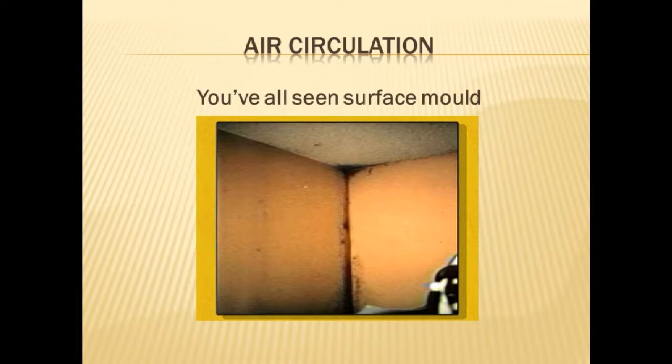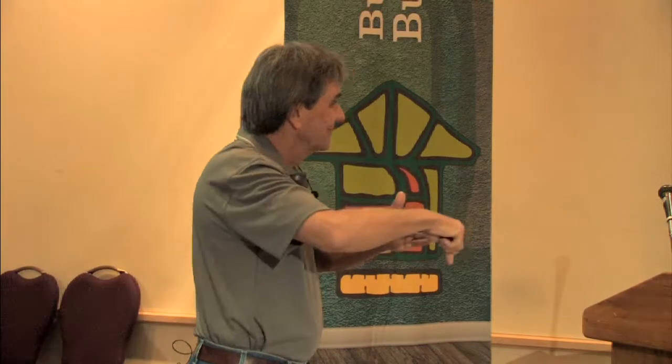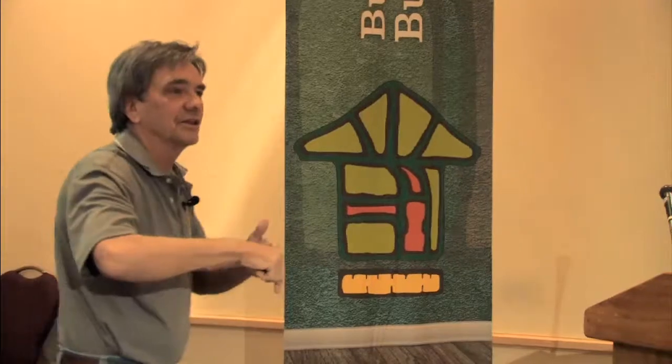And there's actually air coming between the double header, coming into the drywall. And that's why the northeast and northwest corners of the house are the first places to get the mold. Coming down this wall would mean that they built that poorly, and that when they put the stud walls up, somebody forgot to put insulation in the corner. And so that's why you'll see that there are design details now for building walls that don't box the corner in.